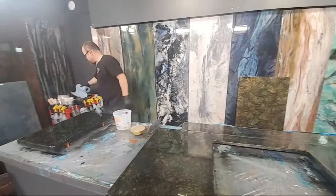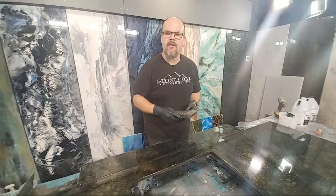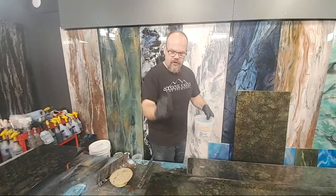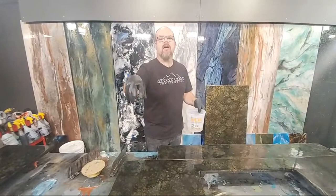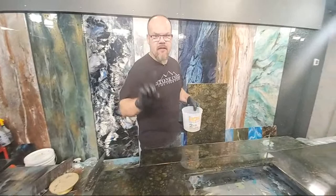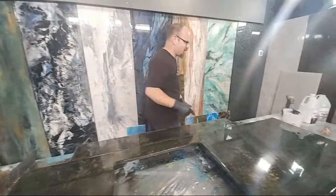We're going to pour this. I like to use a 1/8 by 1/8 square notch trowel — this applies the epoxy evenly and also helps to mix the epoxy because it has teeth. We'll apply it with the trowel and then chop that with a brush. I have a brush right here, and I've pre-primed it — that means I've already put it in clear epoxy. When you chop the surface with a dry brush, it's going to pull some epoxy up off the deck and you could get a dip or low spot. If your clear isn't laying out like glass, it's because you have slightly too little material. That's why we do three ounces per square foot — enough to lay out, but you won't waste material.